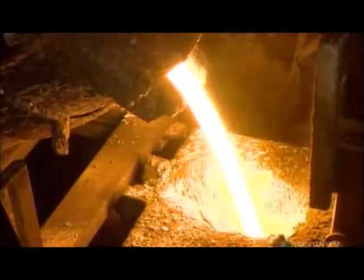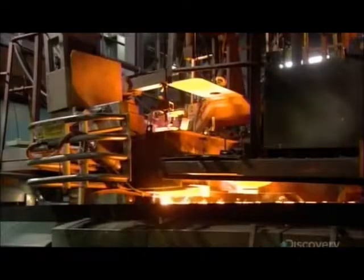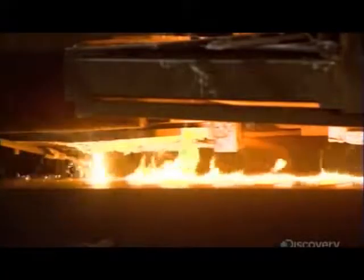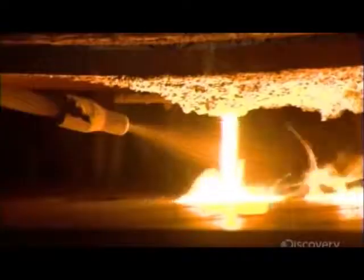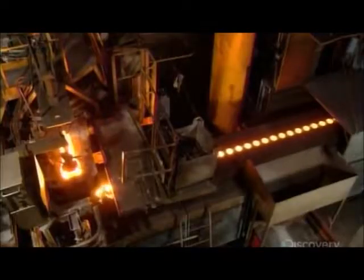It's essential that the pouring temperature be precise and consistent, so they transfer the iron from the melting oven to a temperature maintenance oven. From there, they pour the molten metal through a mere 3 mm gap between the mold halves. The process is entirely automated because the pouring angle and speed are critical. The molten iron cools and solidifies in 20 minutes.